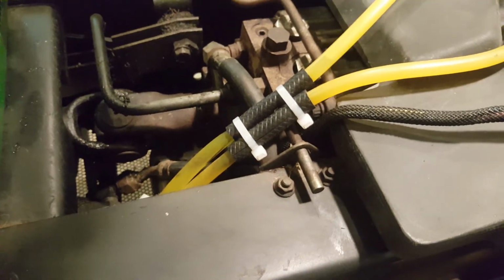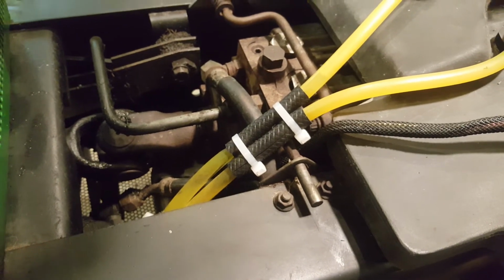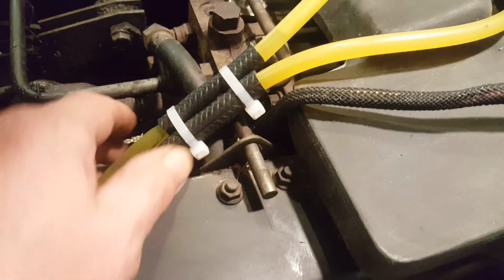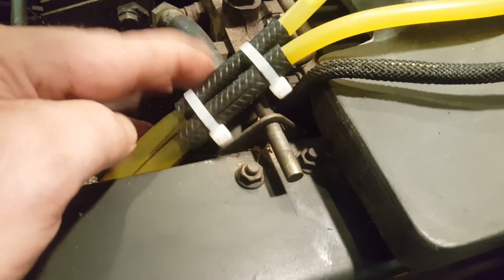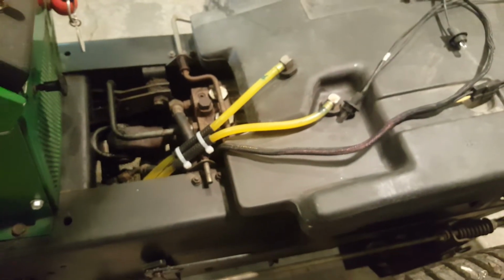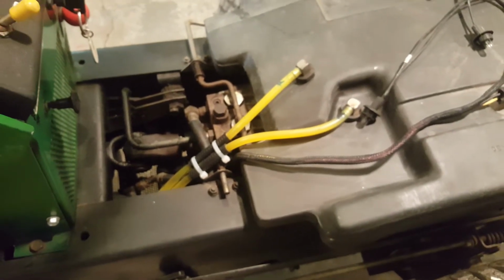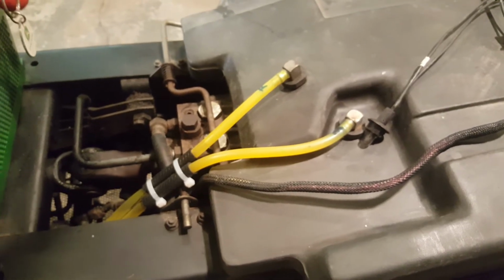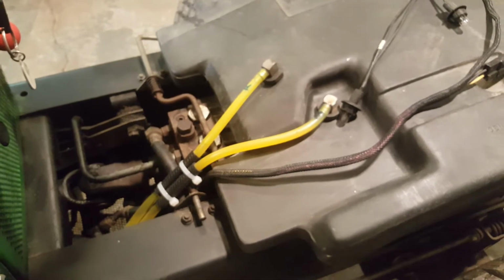I'm kneeling down. I'm going to pause and stand up. These Tygon fuel lines, when I had this deck off just recently to give it a going over, I put those protectors around the Tygon, even though what it's laying on doesn't move, but you've got vibration and stuff. And even though Tygon is wicked good tubing, the kidney dialysis machines I used to maintain were plumbed entirely with Tygon. It's impervious to formaldehyde and bleach and any other chemical, gasoline and any other solvent you throw at it. And it's very abrasion resistant. Very expensive tubing.